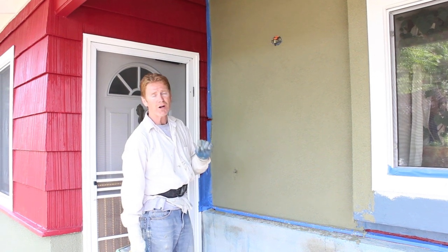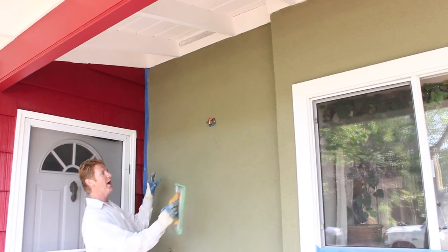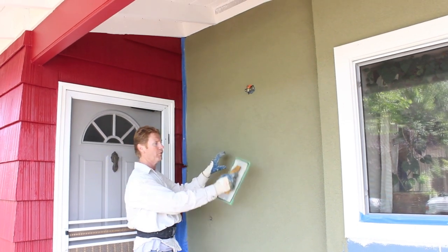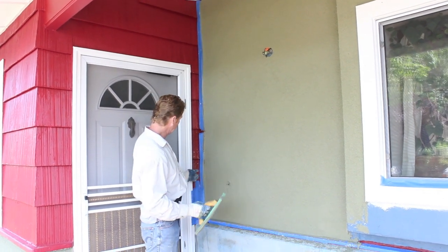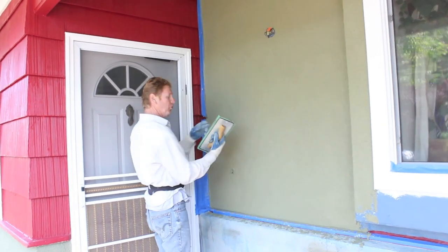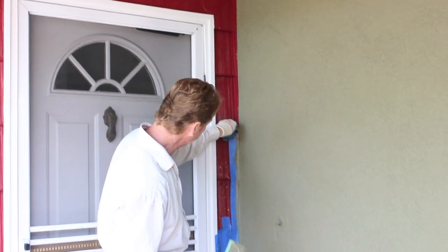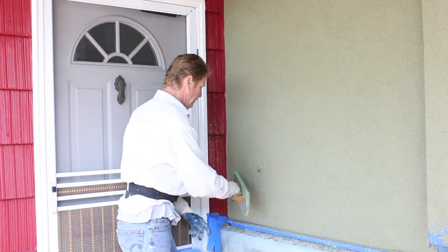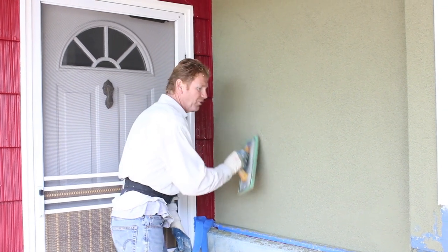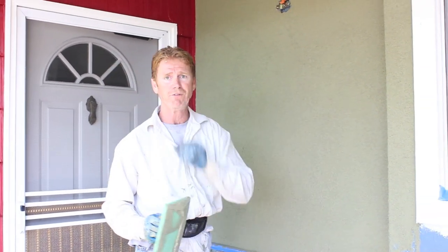Let me show you a typical thing I'm asked very often, almost every job: should we paint first? Yes. Paint your eaves first, paint your trim first. That way, once we have this color coat maintenance-free finish on here, you're not dripping all over our work. Is there a little bit of touch-up? Of course there's a little bit of touch-up for any house. We're using this blue tape right here — we float it and we're using water on here. So when we pull the blue tape off, water can go behind it. If we use the red vinyl tape, that'll pull the new paint right off. So we use the blue, but I always tell folks there's still going to be a little bit of touch-up. I want to make that clear as far as expectations — there's no such thing as me, and I'm pretty good at spreading and floating, not leaving a few crumbs here and there when we're done. It's always better for you folks to paint first.